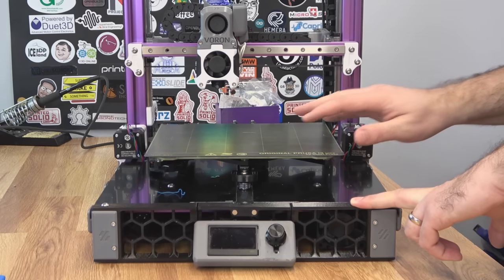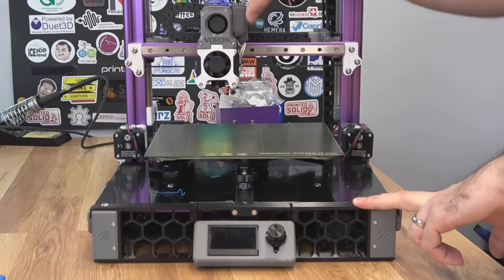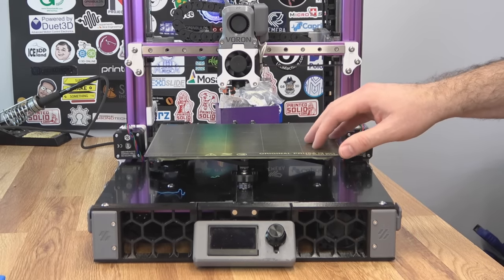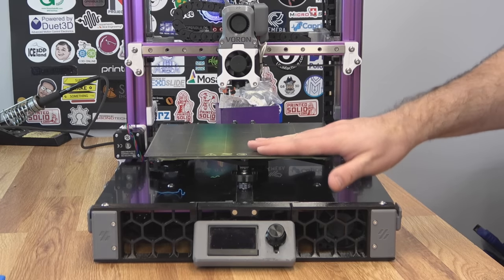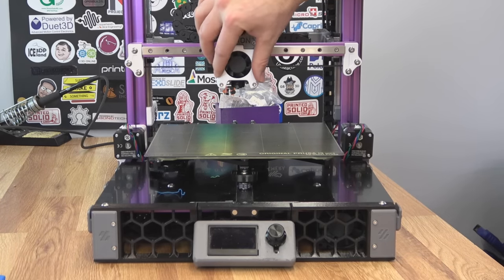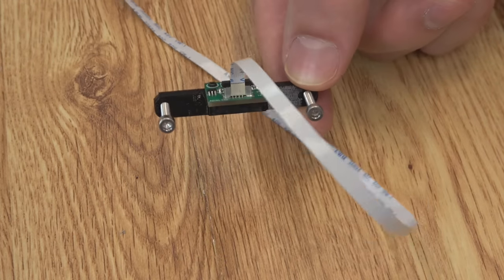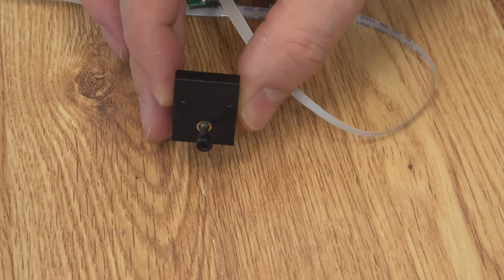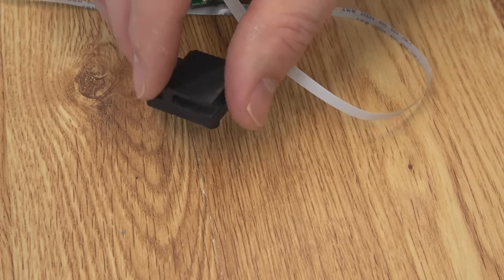Today we're using our Switchwire — we have a moving bed back and forth, and then we have our toolhead left and right. So you're going to have to move that sensor and take different readings. You'll need a mount that fits on the bed, and then move your sensor over to the toolhead to get the X calibrated. This is a printed part so we can put it on the front of the Voron on the toolhead for X. And then we have another one with a screw that you can clamp down to the bed to do Y. We'll start with X.